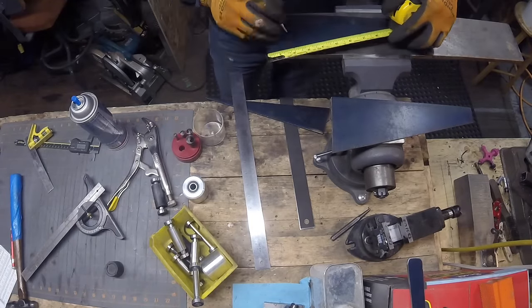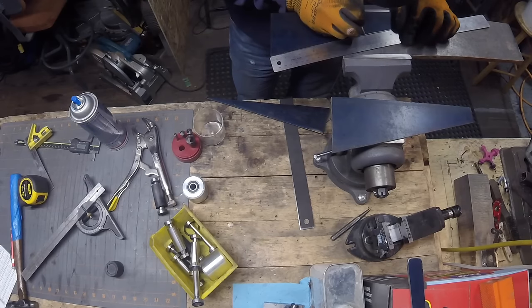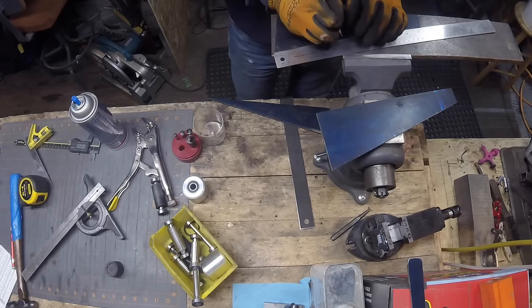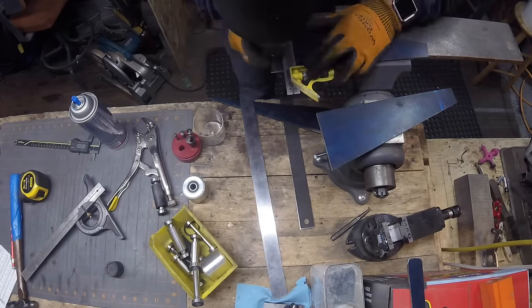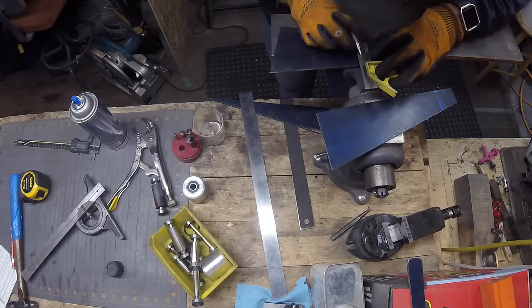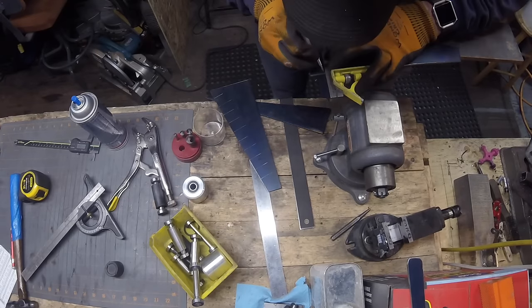I was sorting out the spacing, and for these wheels that I have I decided to do slots that are one inch apart. So I marked those out and then I take a scribe and scribe a little line there. The reason for that is when I went to machine these, I didn't want to have to worry about dials and reading the mill.